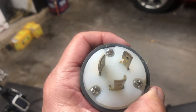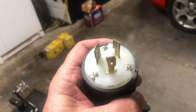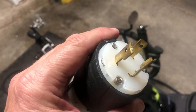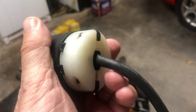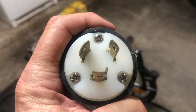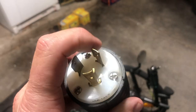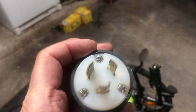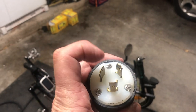I'm going to pigtail this into a regular 120 volt. That bottom prong is going to be your common, and then your top two is red and black. But when you get into this you'll see that a 120 system won't have red and black — they'll have red and white, or black and white. Usually black and white and green. So what you want to do is just kind of ignore that. The black and the white will now become your hotlines, and your green wire will become your common in this case. That's why this is a little bit confusing, because the colors change when you go from 220 or 240 to 120.